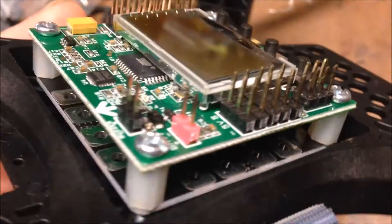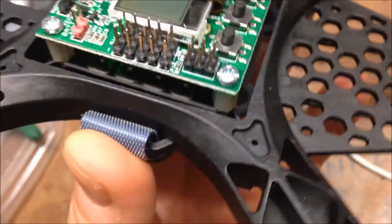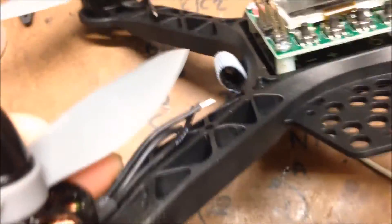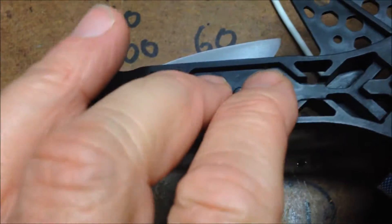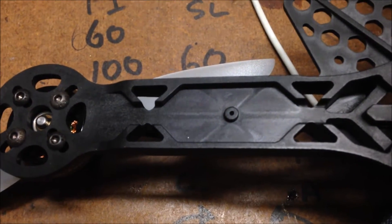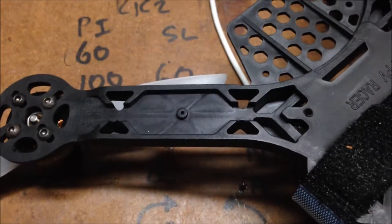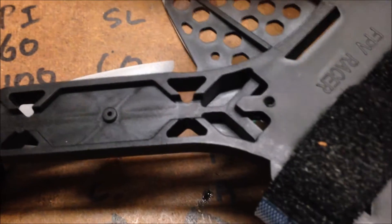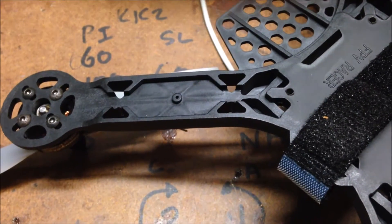This is how I'll be mounting the controller - just a few spacers, power board underneath the controller with a screw through the lot and down into the frame on the bottom. For the ESCs, I put them on top of my 250, but there's a little ridge on the top of this frame so that doesn't really work. I'll probably place them in the dedicated spot here, which is sort of designed for them, and push the cables up through the gap straight into the power distribution board.